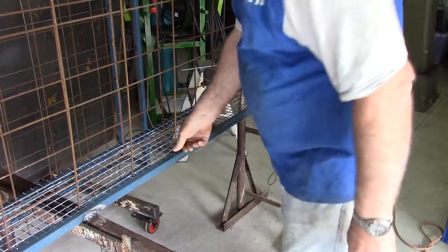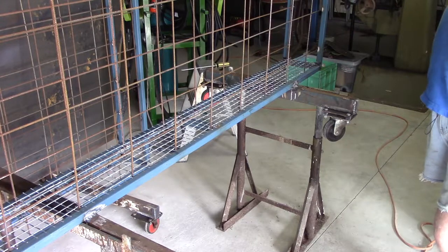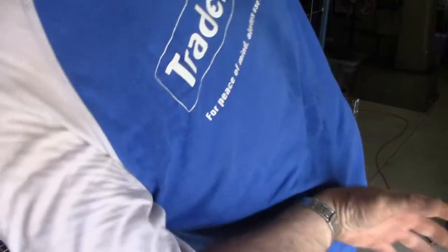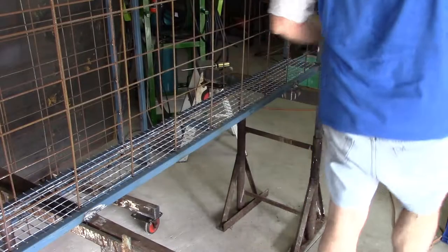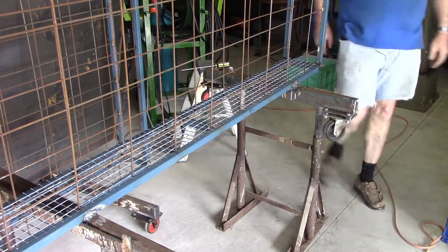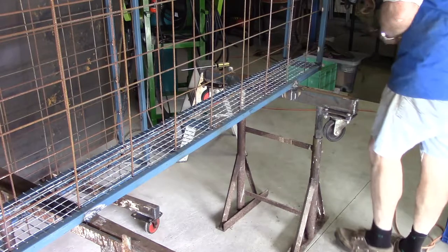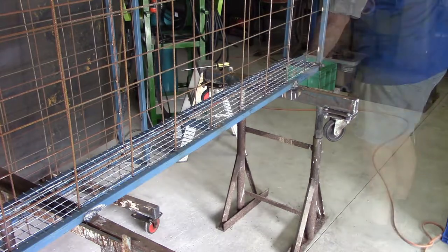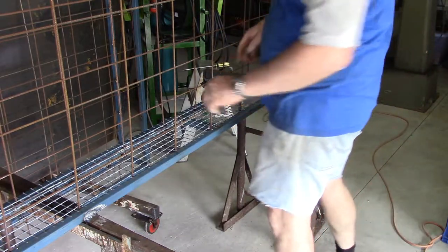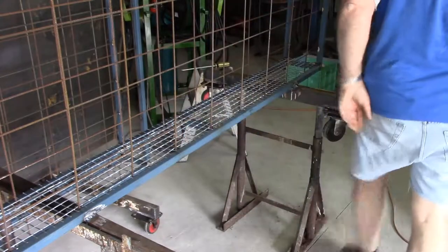I've got to worry about all these wires sticking out. I'm sort of half inclined to give that paint a grind along there and just touch the ends of these with the TIG torch and do a tiny tack weld just to settle them down so that no one will get caught on them — it's the lesser of two evils, I think. In order to TIG these ends in I'm going to have to lift this back up a bit again, which is going to be easier said than done because I've jammed it in there.